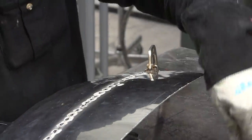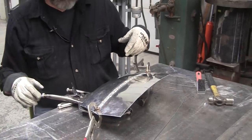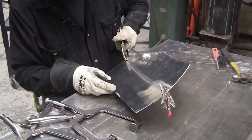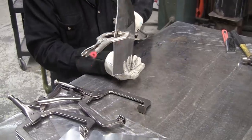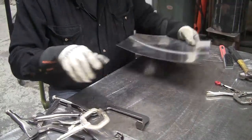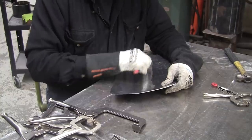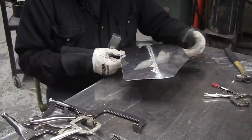A little bit of gap was forming over there and it opened up — I had to lay a little rod right there. So now I've got this side all tacked up. The tacks came through but they're not really a weld — you could break this off very easily, there's no strength in those. So now we're just going to give it a quick brush treatment.